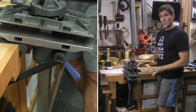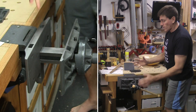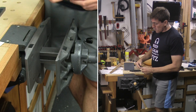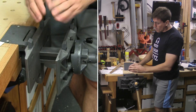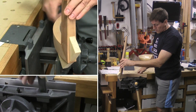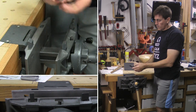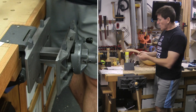The vise does have a very sturdy screw here in the middle. It's a square plate so that everything stays registered together very well, giving you about two inches down before you hit the top part. This comes with four dogs with springs, and with these four holes we can put these dogs wherever we'd like at whatever height. Something like this could be useful if you're holding something that's round or oblong. You could also use it on something even as round as this — it's going to pinch it on the two dogs on the front and the two dogs on the back. Now these dogs are reversible: there's a square-ish tapered top, but also a side that's round, so you can place the round side in instead — that's actually the best way to grab something with a small curve on it.